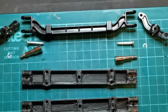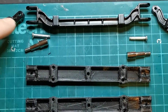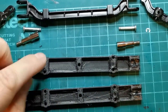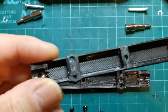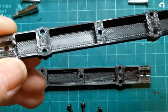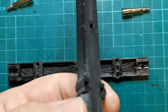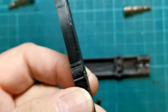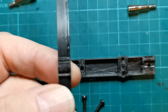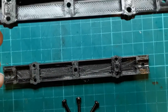This is your standard front axle beam — these are your front pins. You take these apart and 3D print this part here. Now this part is the same both sides, so you only need one and then you can just 3D print it. I've had a look online and a lot of scale axles are actually square with rounded edges. This is printed in low quality just for mock-up, but you could print it in higher quality and get a better finish.